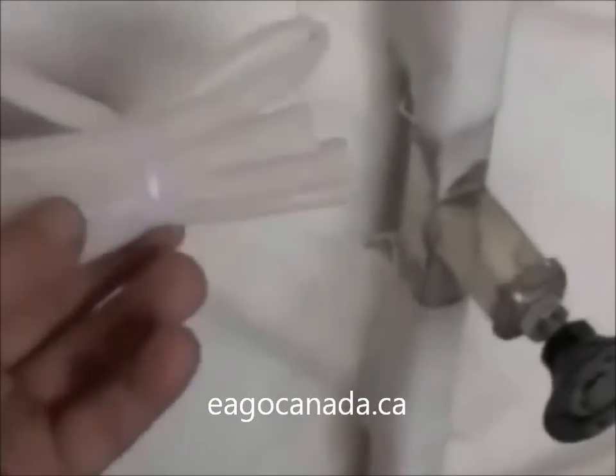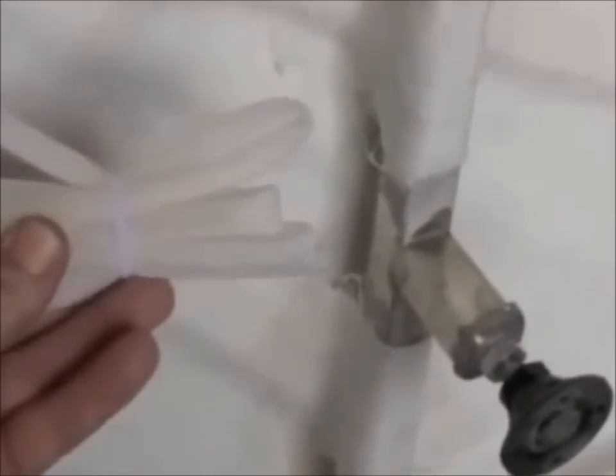You got your drain, so you want to cut this zip tie, have the drain down so it's going to sit where the drain area goes. This line is going to go to the drain for the steam shower or to the steam generator, so we'll cut this and run it to the back for the steam generator. Now this top plate right here, it's going to be sitting at the front. You can remove it for access afterwards — simply just thread this counterclockwise. There's a little Phillips screw there.